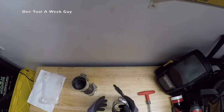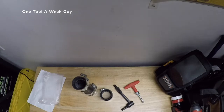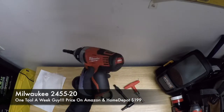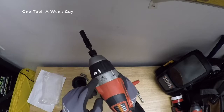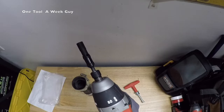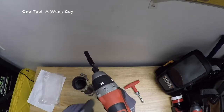I could have gotten another Rigid torque tee, but I really don't use huskies that much — I most of the time use clamp-on. But I did find this really neat tool that I fell in love with, and I'm sure you will too. I went ahead and picked up the Milwaukee 2455-20 M12 no-hub coupling driver. I picked it up as just a bare tool. It has three features: the first is your regular zero to 750 RPM drill mode for general drilling or fastening. After that you get into specifics — you can set it to 80 inch-pounds for huskies, and then 60 inch-pounds for no-hub bands. So instead of switching from your impact to your torque tee, all you have to do is keep drilling with this.